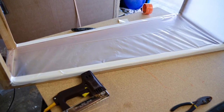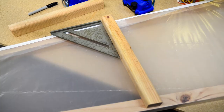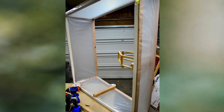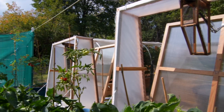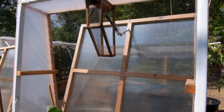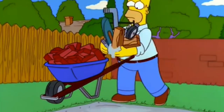At this point I decided to add a couple of braces to the main frame to add structural rigidity, since the chain stays that support the frame while it's pivoted back might bend and flex the side rails. I would have added these internally to the frame sides before enclosing them in plastic had I realized I needed them, but I didn't think of it before putting the plastic on, so I attached them to the outside of the plastic but inside the frame. This is where you have an advantage watching me make the mistake so that you can go straight for the successful solution.